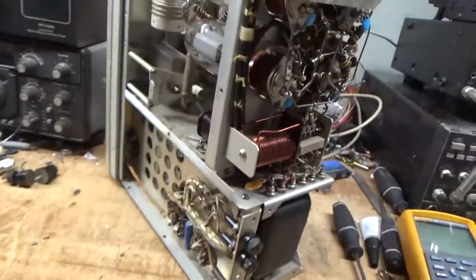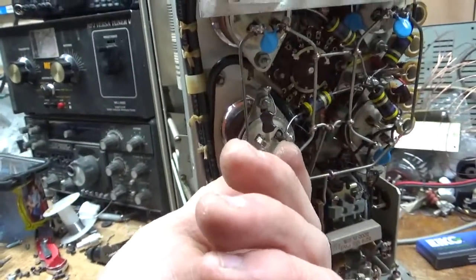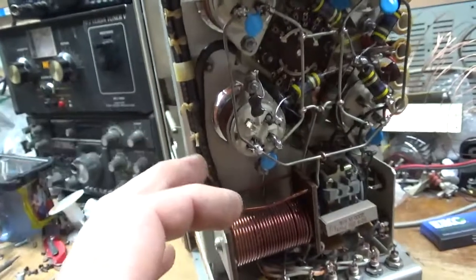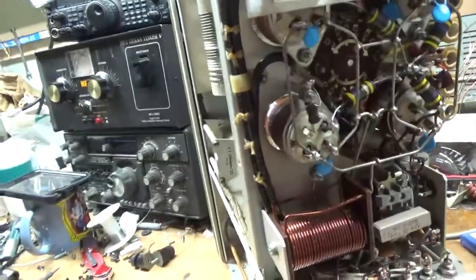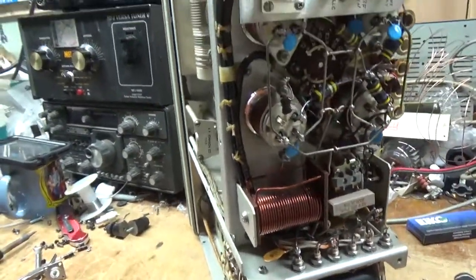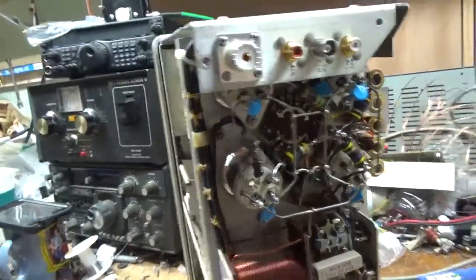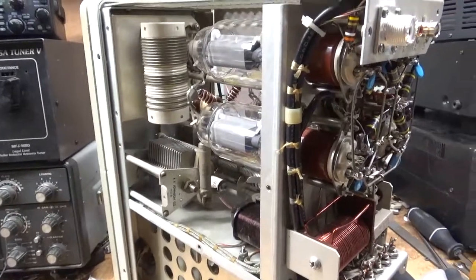The feed-through was loose — the terminal on the other side was loose; you could move it back and forth. I took it off and tightened the nut on the back real good. I also compressed all of the socket clips — the old tubes were sloppy in the sockets — so I compressed them carefully with right-angle needle-nose pliers and cleaned the sockets. One had a damaged clip that I had to remove and replace. Now they all have a nice tight connection; you just don't want the grid to open up. It's an old amp but a great, awesome amplifier — this work is really needed. Thanks for watching. If you need an amplifier repaired, please feel free to give me a call: 203-892-4119. Take care.